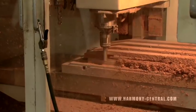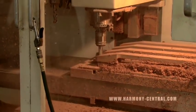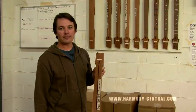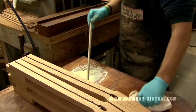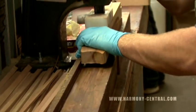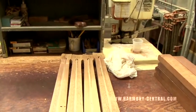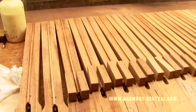The next cut is a profile cut of the neck, outlines the headstock a little bit, and it routes for the truss rod. The next thing we're going to do is insert the truss rod. We have a double action truss rod — one way corrects forward bow, the other way corrects back bow. These are very sensitive truss rods. Pretty cool design Paul came up with there.